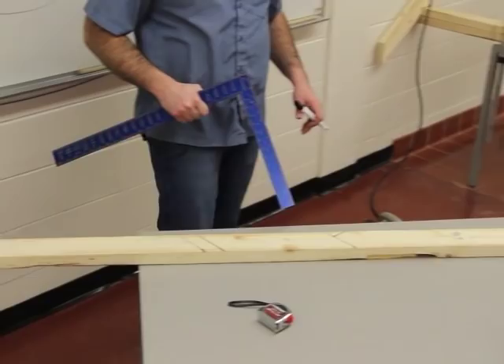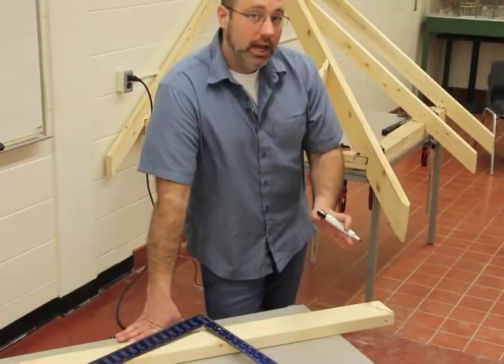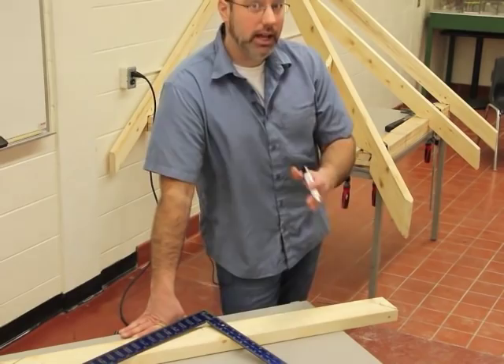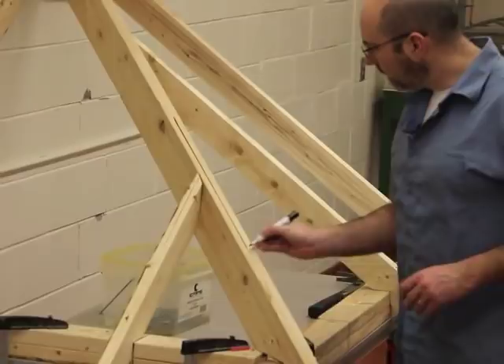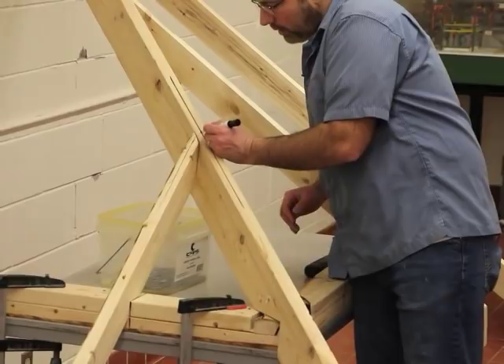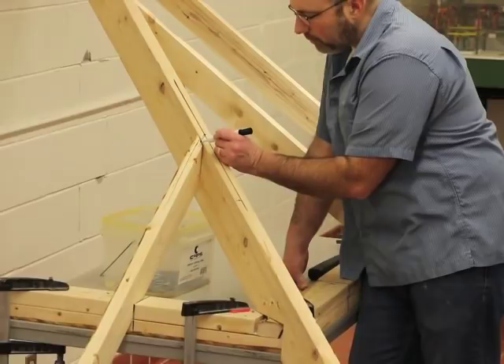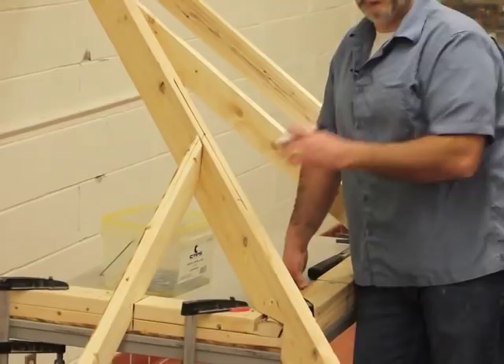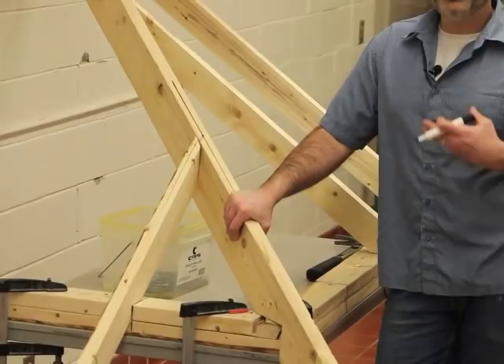Moving up to the top, I have to shorten my top plumb line by one half the 45-degree hip stock thickness. Coming over to the roof that Travis put together: if we find the center of our hip and draw a line down the center of our jack and draw our lines up, we're left with this discrepancy, which is not half the hip stock thickness measured at 90 degrees — it's half the hip stock thickness measured at a 45-degree angle. So we need to shorten the top of the jack by half of the 45-degree hip stock thickness.